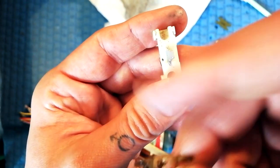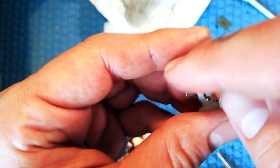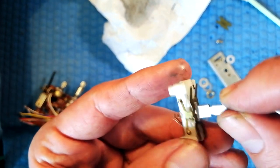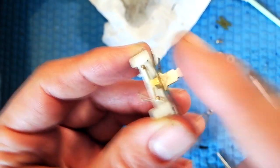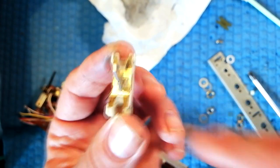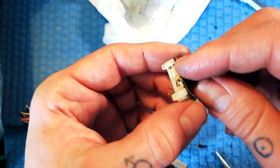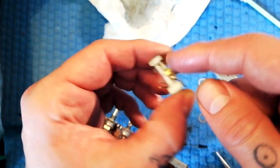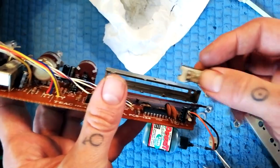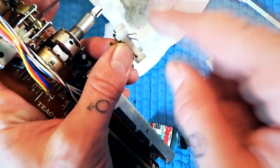You can see it's not symmetrical — there's a gap on one side, so that's the side that goes onto the track. This part doesn't serve any electrical purpose; it's really a spring to stop there being too much give against the top or side of the fader. I think it's also just to reduce friction. Then you just slide it back in — I usually have the brush bits pointing down the way, since that's up on the fader.